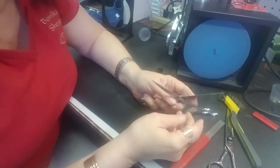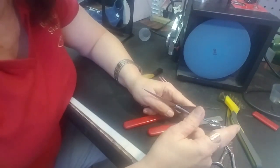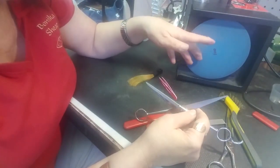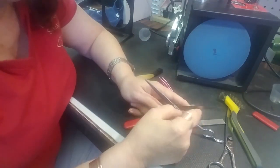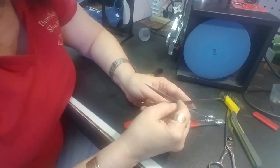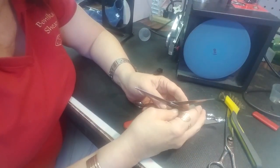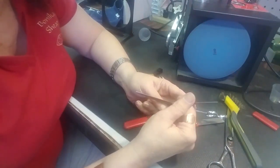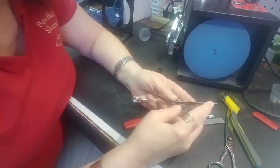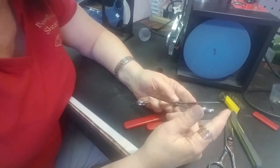There are other alternatives. If you don't have serration files, you can sharpen that side with a very coarse grit — something like an 800, 500, or 600 grit — and just leave that side alone where it has a little toothiness to it. You can tell your customers it's a 'graduated serration' or 'graduated corrugation' — that was actually one of our ideas at the sharpeners jam. Tell them they won't see the lines, but it's like no-line bifocals. Another choice is, for hair salons, talk to them about taking the serration off so you can change the angle and make it a little sharper and smoother.